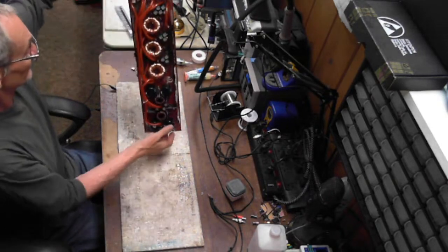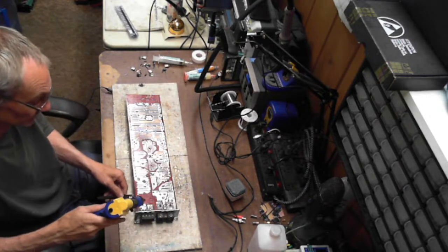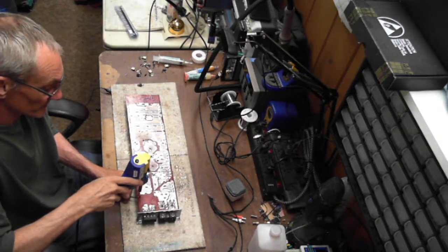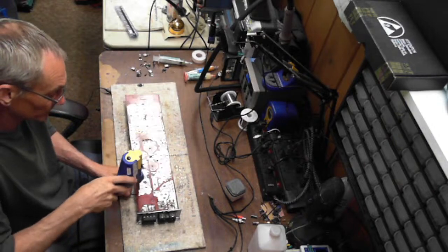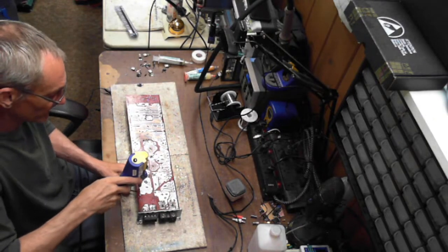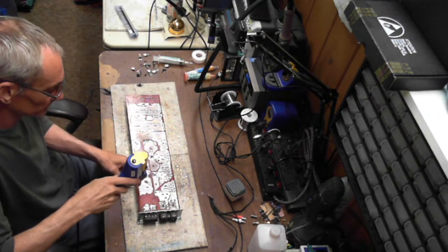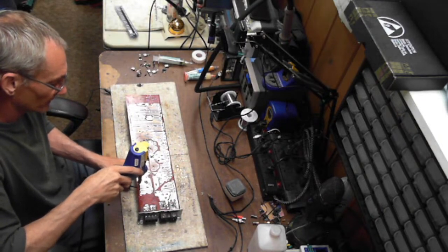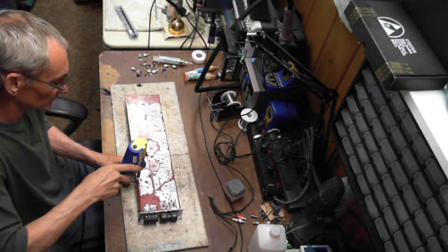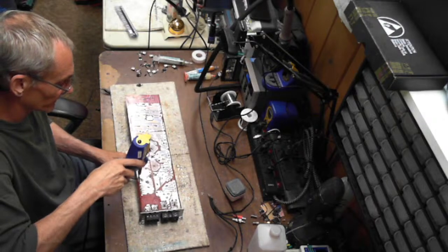Oh yeah. And then we'll just pull the other side. It's one of the first things that you do after you fix an amp: check, make sure you have drive. Which I know this doesn't have drive because the transistors that are used to drive the gates on this are burned up. So it's the same layout as all the Audio Pipe amplifiers that use the same Type 4 design. But this is what I do every day. Every day.